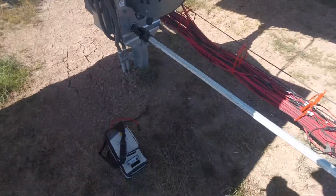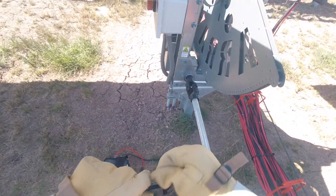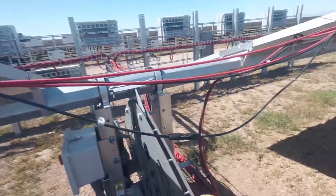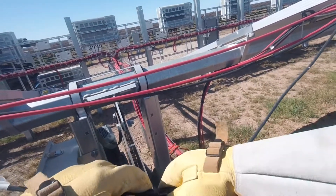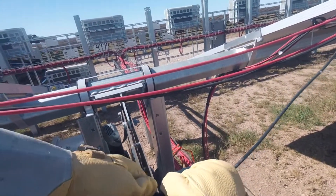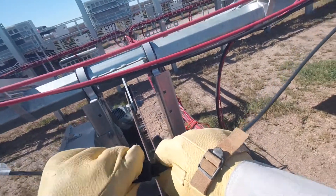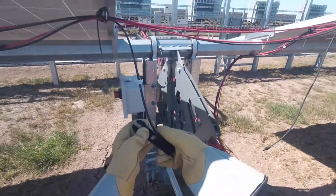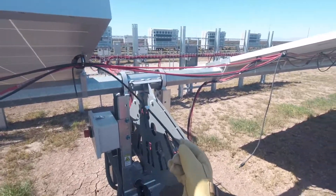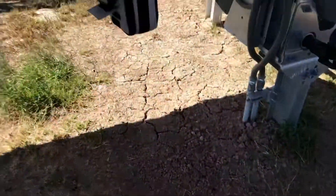Let's try the black one. Inline connector tool — the connectors are built into the bottom of the Huawei inverters. Take the blue plastic tool — there we go. That was under load, that's why I jerked it out of there fast. I used these gloves. So now this string is dead. The Solmetric PV 1500 analyzer is hanging there, close to the one module we're actually testing, because the cables are only so long, and we're hooked up to this module.